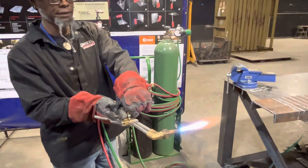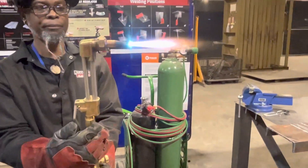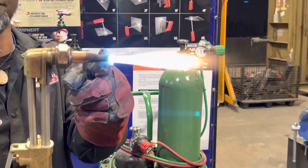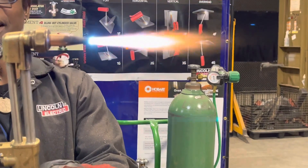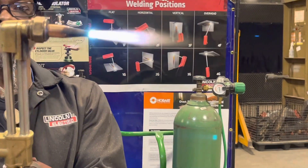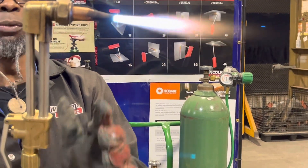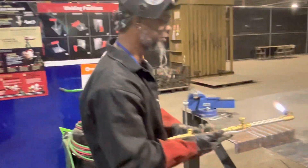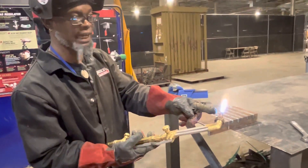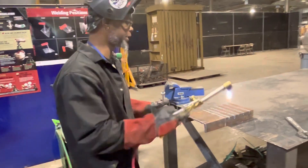You want to get a fine-tuned flame — you can see the flame pretty well but it should have some good defined teeth in it. You want a fine-tuned, sharp inner cone. When you hit the oxygen trigger, you want it to still have those fine-tuned teeth — see how that didn't change? You want to be able to hit it and still see your marks; that way you know it's going to cut really well. The marks on the tip indicate how far you want to be from your metal — about a quarter inch — and normally it tends to cut pretty good at that distance.